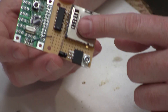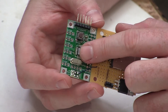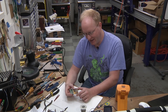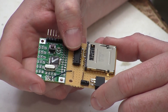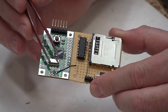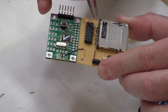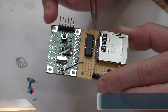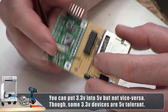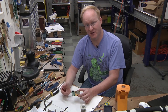What I've done here is I've attached an SD card to one of my AVR boards. SD cards always run at 3.3 volts and this is a 5 volt AVR board. We could have possibly run the AVR at 3.3 volts — I believe it is in the operating range — but I elected instead to use this non-inverting buffer to act as a voltage conversion circuit. I've taken the three lines that are output from the AVR — master out, slave in, clock, and chip select — they go through the buffer. The buffer is powered at 3.3 volts so the output will be at the same voltage level as the SD card.